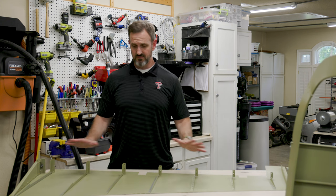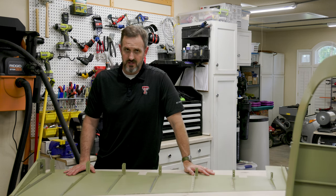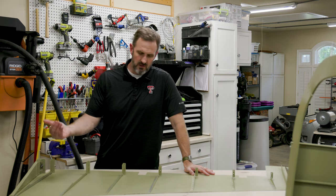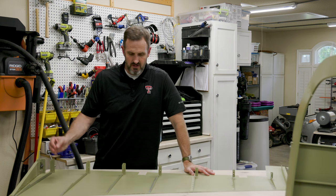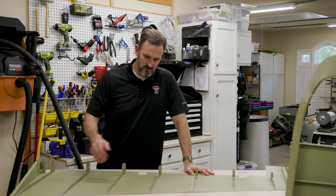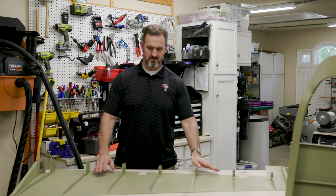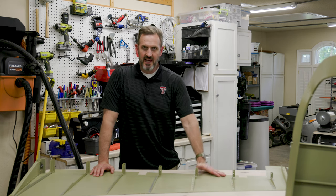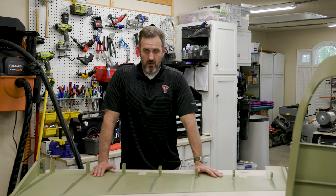Hopefully I'll have a friend come over and help, otherwise I'm doing it on my own, which will be a pain but doable. After I do that, I need to wait about two weeks for the tank sealant to fully cure — I've found it takes that long. Then I'll take it off, do what I did on the elevator's trailing edge, rivet the trailing edge flush, curl up the front edges, and finish a few other things. After I put the second half of the rudder on, most of the hard work is going to be done.